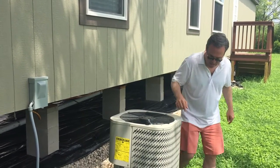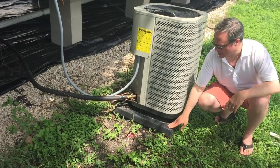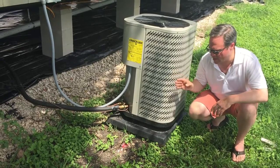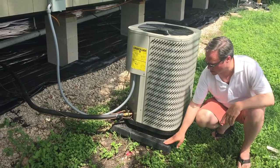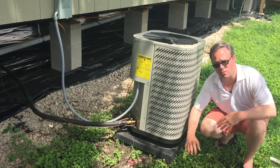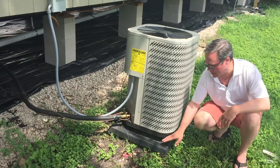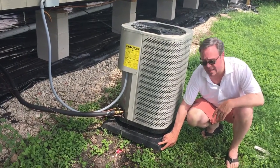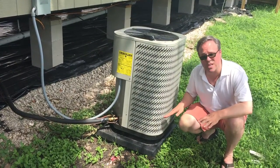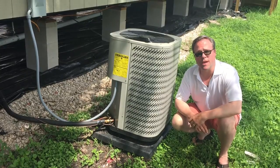Let me just point out — this one is set on a plastic pedestal. Sometimes these will be concrete. You don't want to put your heat and air unit directly on the ground. This is a proper set — you want to have this up off what might be damp ground. We typically use either these sorts of couple-inch thick ABS plastic pads, or we'll actually pour a concrete pad and put the unit on that. That's a proper set.